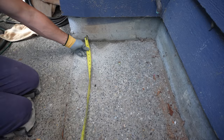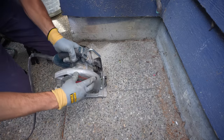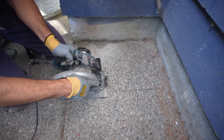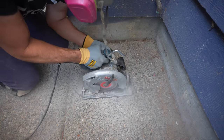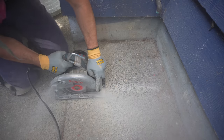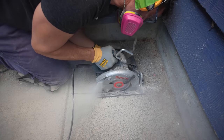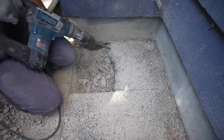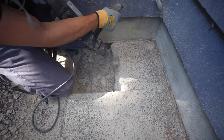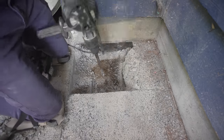Hopefully you don't have to cut into your concrete, but on our application we do, and it's fairly easy as long as you have the right tools. I want as clean a look as possible, which is why I'm taking a circular saw with a segmented diamond blade and scoring the edge of the concrete. This slab is over 4 inches thick so the saw blade won't get all the way through, but at least I can have a nice crisp edge at the top, and then backfill it with concrete once everything is in place. Just make sure you have a proper respirator — you don't want any of this dust in your lungs. Once I have two sides cut as deep as possible, I grab my Bosch hammer drill and start jackhammering out all the concrete, which took about an hour.